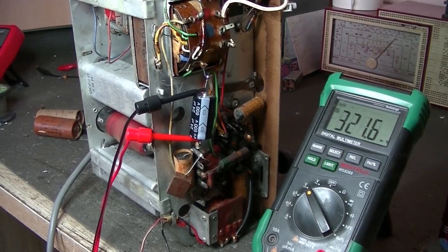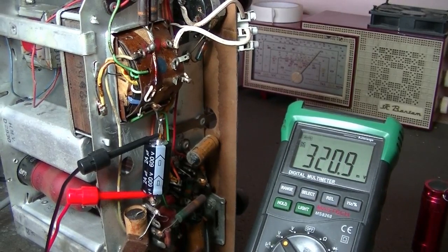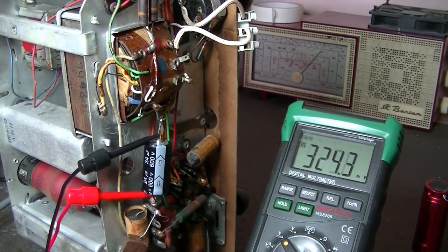And we've got nothing. Why isn't the dial globe lighting up? Okay, let me just check my connections. Okay. Don't know what was going on, but give it another go. Yeah, it's just trying to test me, I guess. Boom. Okay, I'll bring it up to 180. And the voltage is dropping. But the radio is alive. I think I want to see more than 98 volts.